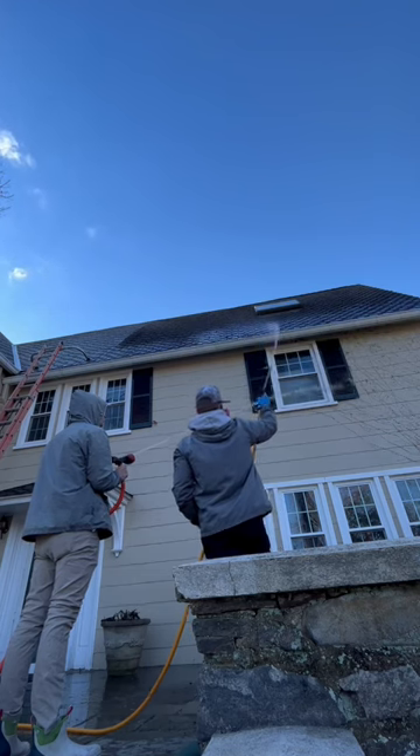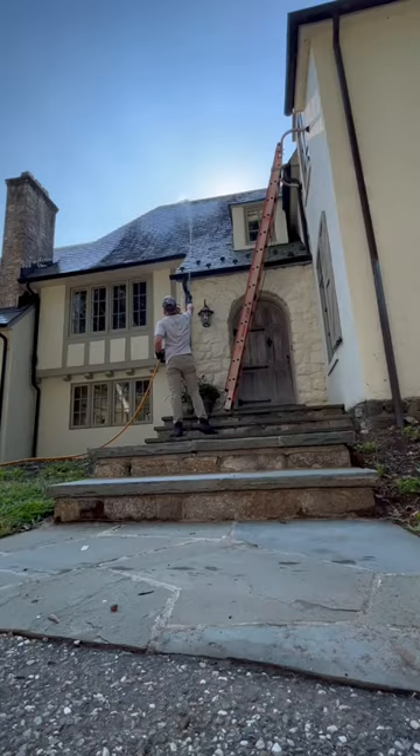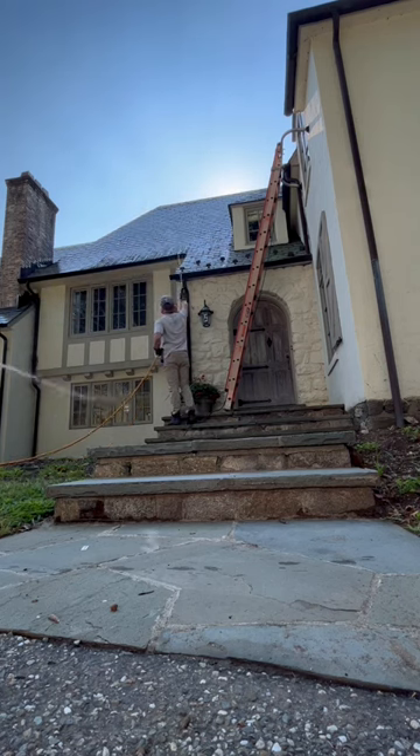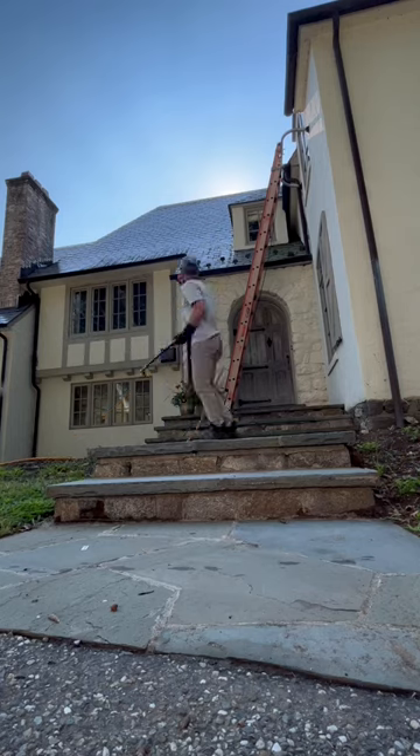When you buy the pool shock, dilute it at least by half with water to get a 6% mix, dilute it by 3 parts water to get a 4% mix, or dilute it by 4 parts water to get a 3% mix. 3 or 4% is usually what we use for most roofs.